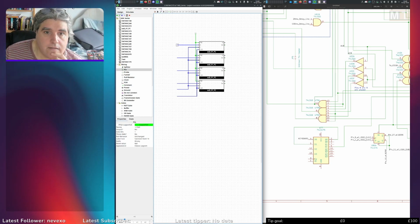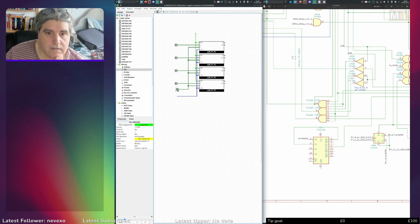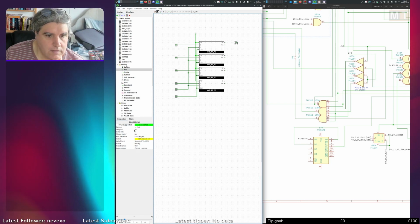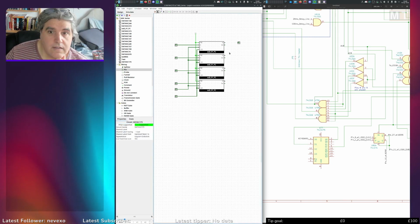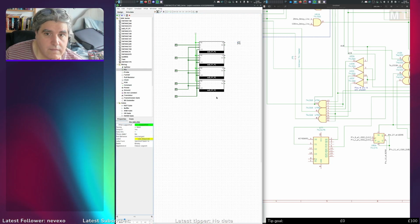Okay, what have we got? Pins now. I'm just going purely by the symbol on the schematic as to what this chip actually is. I've not looked at the data sheet, obviously. I guess I should do really, but yeah. Okay, west facing. It's pretty obvious what it is. You've got D's, Q's, clock, master reset. It's obviously a quad D.